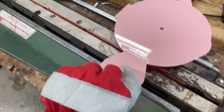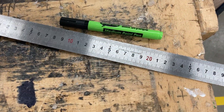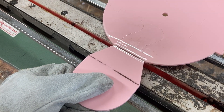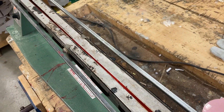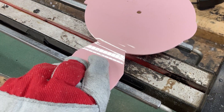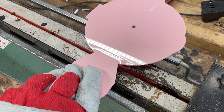The first step is marking out where you want the bend to be. You would use a spirit-based pen, much like a whiteboard marker, and a ruler to mark it on. Then you place the plastic over the heating element of the machine, making sure you are never touching the hot parts. I'm wearing heatproof gloves to make sure there's no chance of me burning myself.